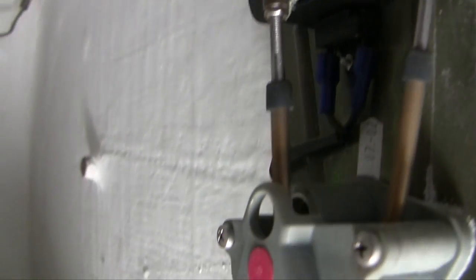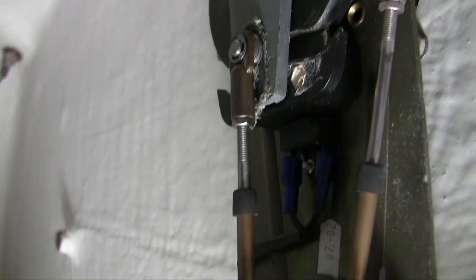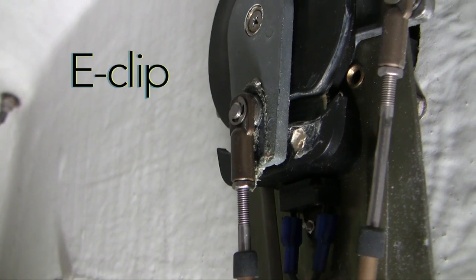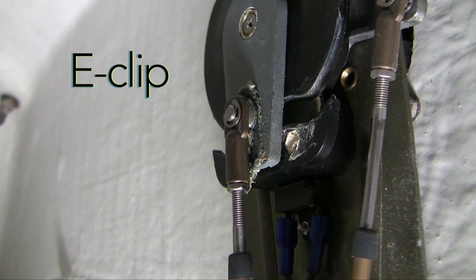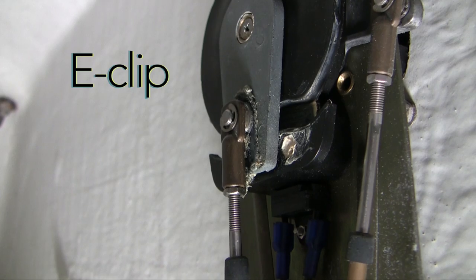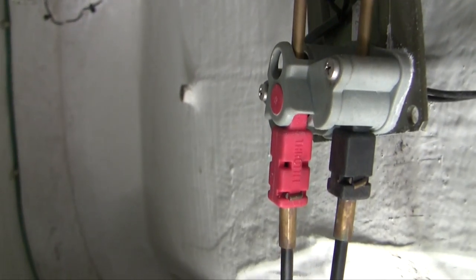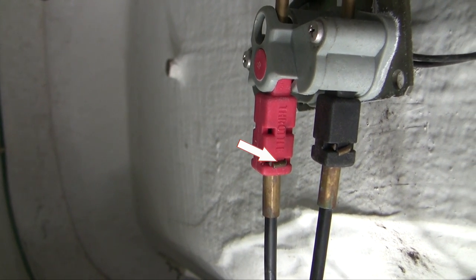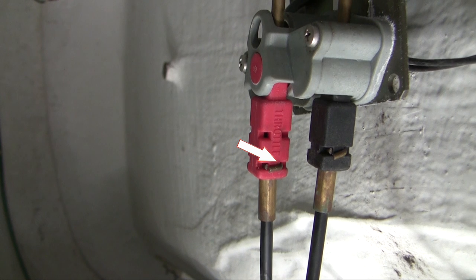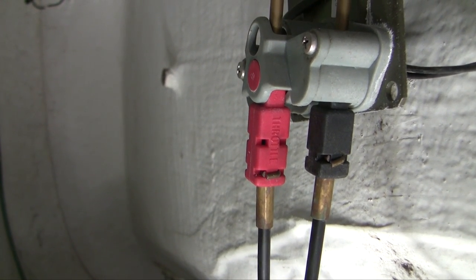This is the gear shift end, and the cable we're concerned about is the red one — it goes through here and ends at the top. If you look closely there's a little snap ring; we're just going to pry that off with a pocket screwdriver. The trick is not to lose it. That's off, and now down here there's a wire staple. I'm going to pry that staple out so that the proximal connection is loosened and we can slide the whole cable out.